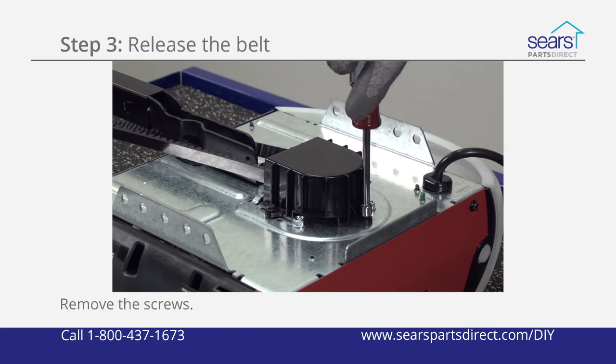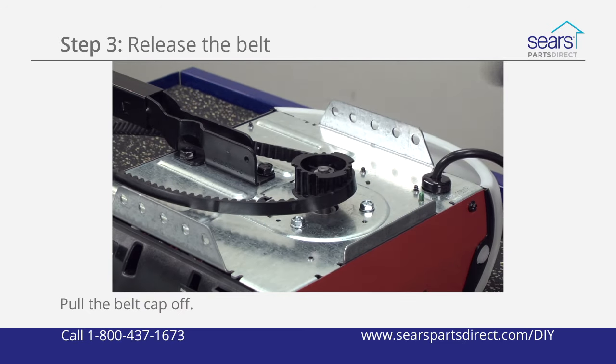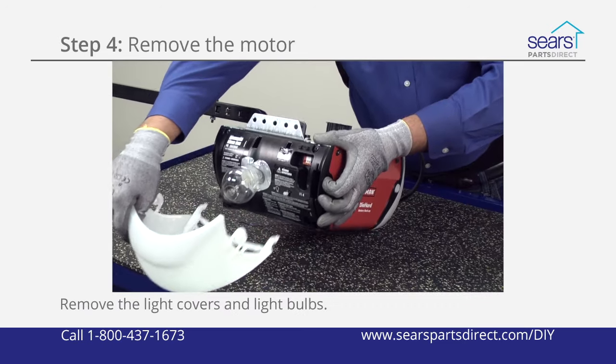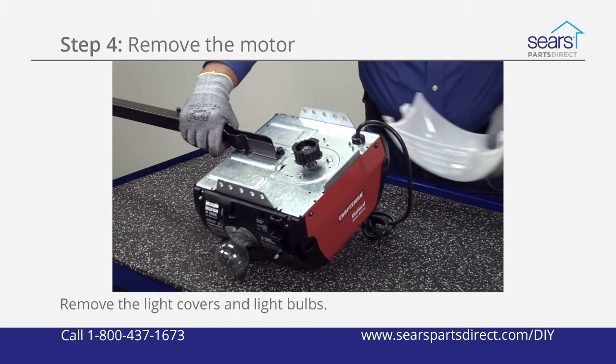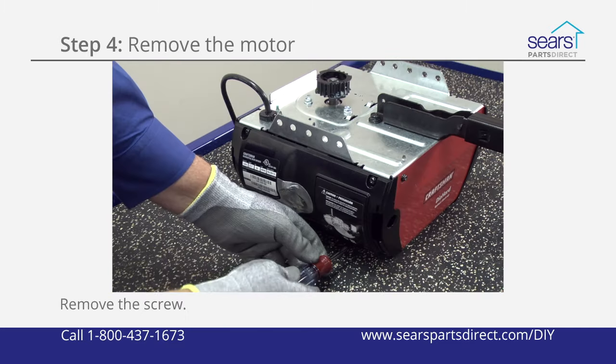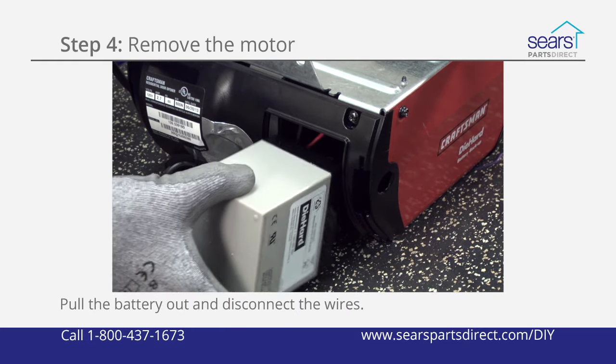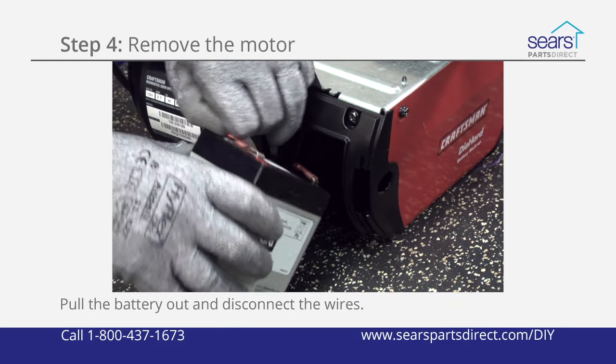Remove the screws from the belt cap on the motor unit and pull the belt cap off. Release the belt from the motor pulley. Remove the light covers and light bulbs from the motor unit. Remove the screw and then take off the battery cover. Pull the battery out and disconnect the wires.